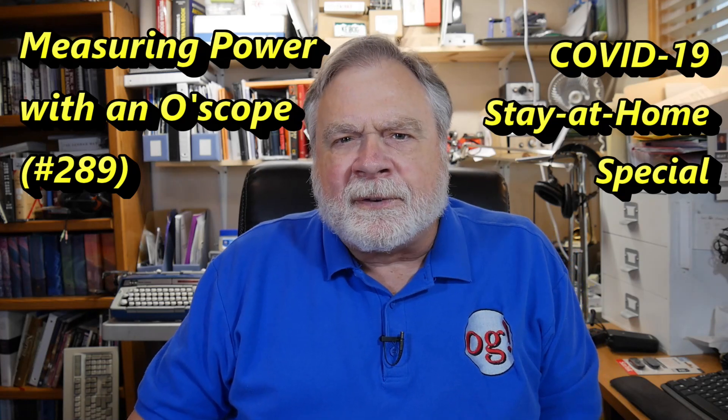An oscilloscope is fundamentally a voltmeter — voltage versus time — so you can get a waveform and look at it. But in addition to just showing the waveform shape, an oscilloscope can actually measure the voltage, as is the case with my Rigol DS1054Z scope, which gives a nice set of measurements. So what we're going to do is put a test setup together. I'm going to use the micro BITX as the transmitter, doing CW into a dummy load — an old Heathkit Cantena — and we'll use an MFJ wattmeter and SWR meter to confirm we have a nice 1-to-1 SWR going into that dummy load.